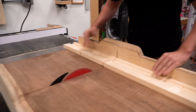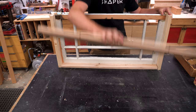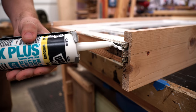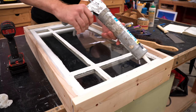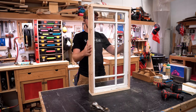The next step was to cut down the frame to fit. With my window situation, I didn't feel like I needed a window sill — this is actually underneath a roof and not going to get any water. I just sealed it up with caulking and screwed it into place with deck screws. I'll post links below to videos for building a proper sill. For a shed like this, it was a faster, simpler approach — but I'd recommend researching if you're in an area exposed to a lot of water.